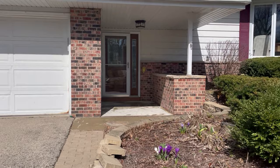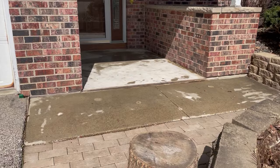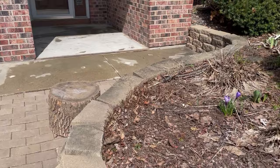After using a broom on the walls, brick and concrete, I used our blower for about 30 or 40 minutes getting it as clean as possible before I scrubbed and washed the concrete with warm water and mild soap. I've heard mixed reviews on using a pressure washer on concrete before painting, and I had a small window to get this done that I didn't have time to wait several days for it to dry thoroughly.